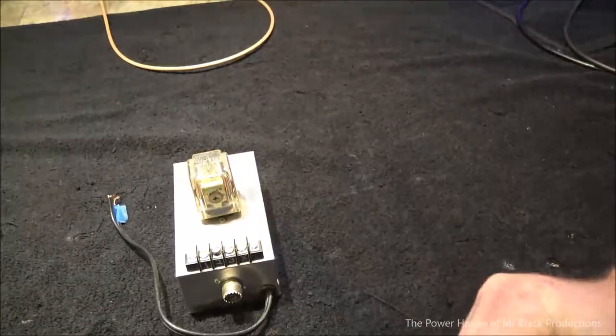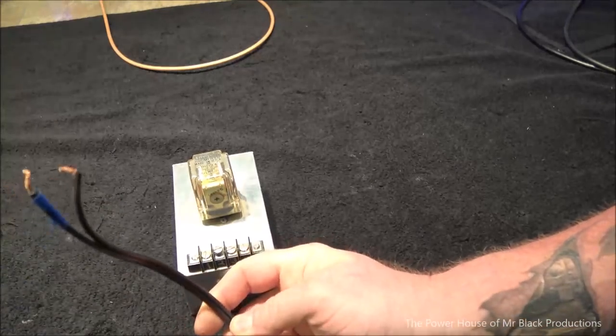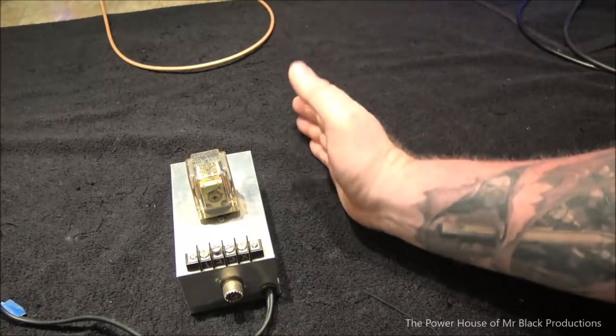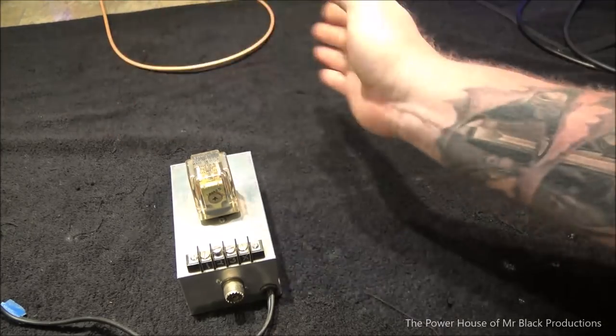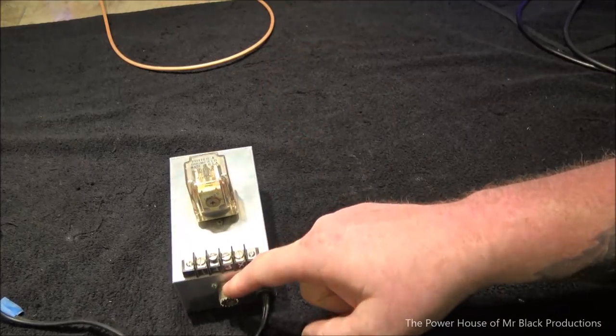And this is it. I have not invented anything new, but I took it to a different page. There's a little bit of weep current that's sent to this thing that runs this relay. And how a Dow-key works is you have a transmitter and you have a receiver. They're both completely separate devices, but they both have to have access to the same piece of coax here.